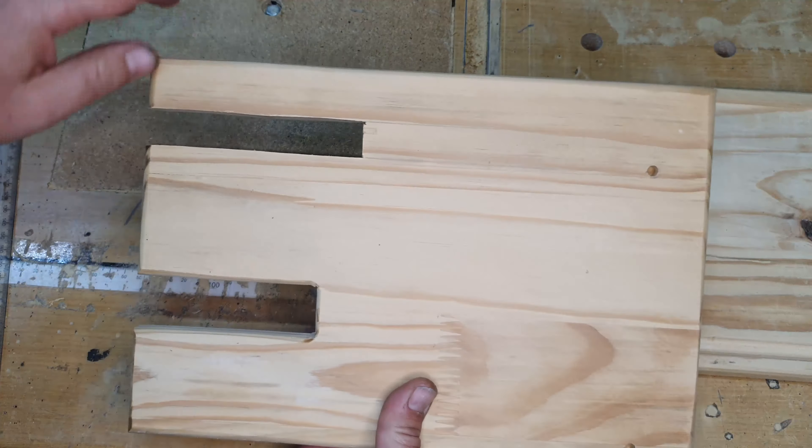The bottom part looks like this — you'll see I cut out the groove, the big hole, and then the groove in the front which I made to hold whatever you want to place in it. This is also slightly deepened so that whatever you put in there won't be rolling off. Now for the magic moment — these two pieces simply slide into each other like this and stand upright. The two grooves are obviously cut to the thickness of the wood so they fit nice and snug, but not too tight — you can disassemble and reassemble it.